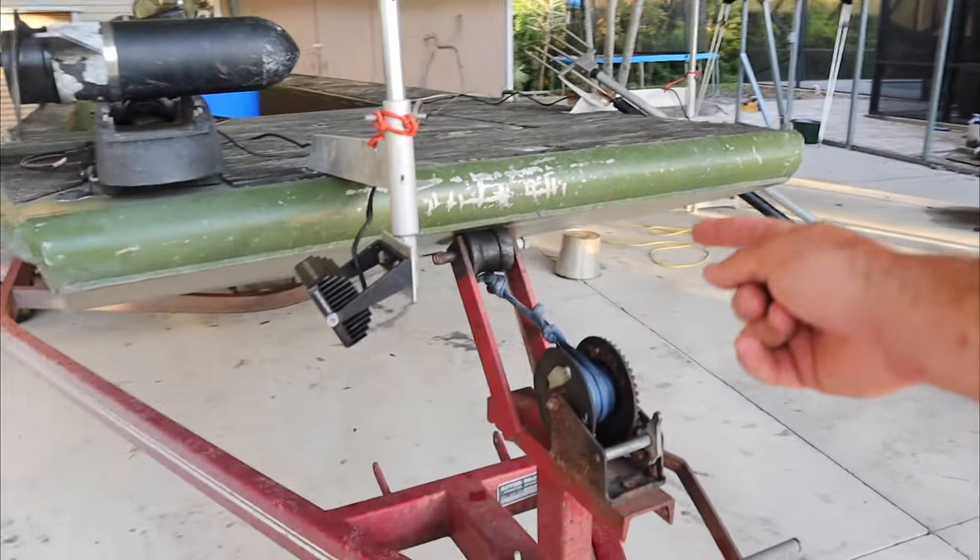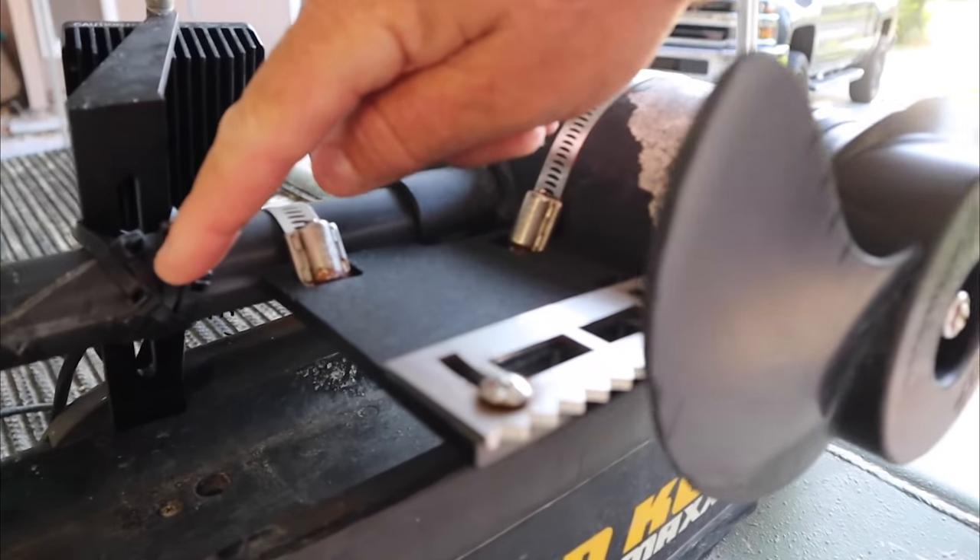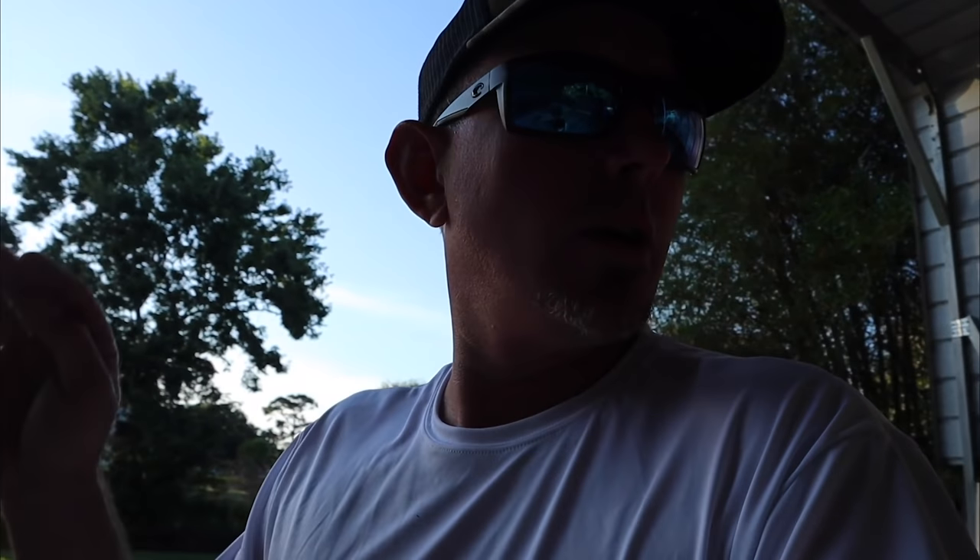I've got a little bracket my buddy James and I built — maybe a hundred bucks in material, took a couple hours. They actually have brackets you can mount on your own boat, or you can build them yourself. I have one on the front, off-centered, so when I load my boat you don't hit it with the winch. I have one on my trolling motor that I just installed with some zip ties. Each light has its own cable and runs to its own individual battery. I used to have them on my trolling motor batteries, but that's three lights and my trolling motor running off them and it would die after about six hours. So now I just bring three batteries — a lot of weight, but that boat can handle it. If you're in a little canoe or John boat and only need one, just bring one battery. But right now let's take it back to the water — we've got great in-the-water footage. I'm going to show you all gigging some of these flounder and I'll be right back.